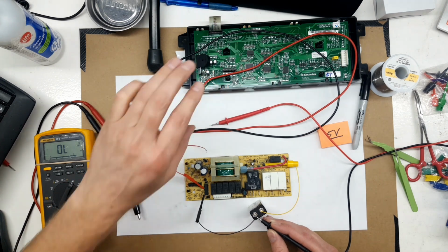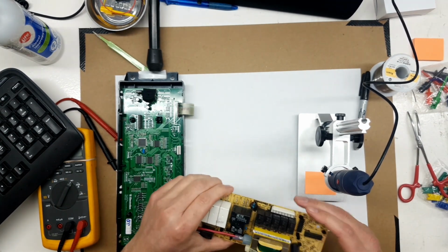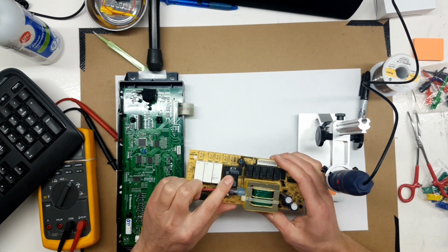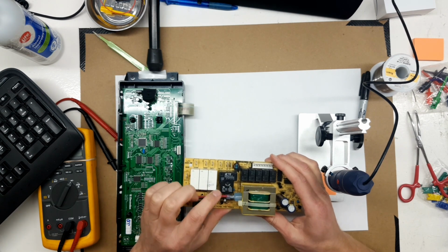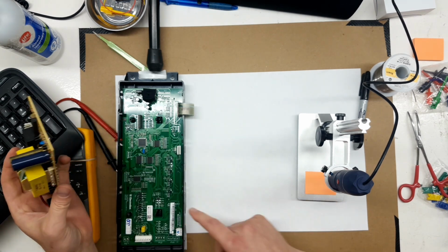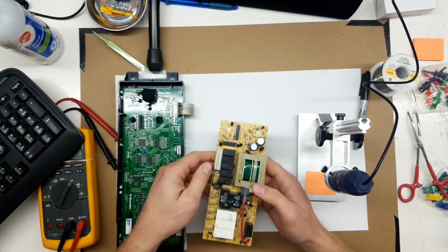There's nothing wrong with the control circuitry for this relay. We've seen that. All of these relays work properly. They all conduct. This one conducts just fine, conducts in the normally closed position, conducts in the normally open position, and the control works fine. If there's 5 volt input here from the microcontroller, it will trigger that relay. We manually did that. So, what is the problem on these boards?